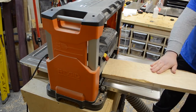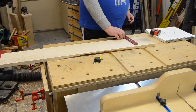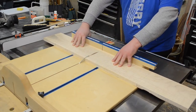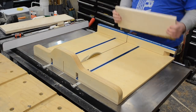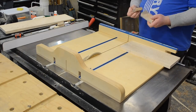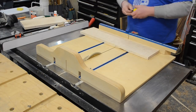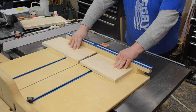Once out of the planer, I restored the markings for all my layout pieces on the face of the board, then took it over to my table saw cross-cut sled and cut the pieces to rough length. I emphasize rough length — I know my planer produces snipe and I allow for that. I also wanted leeway for picking the grain on the top, so I left the top rather long and accounted for snipe on the sides as well.